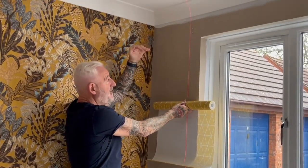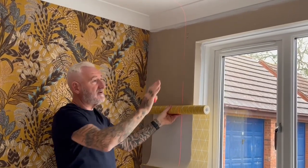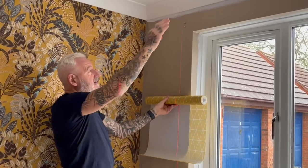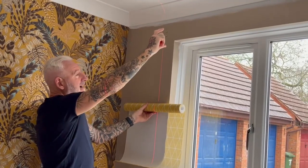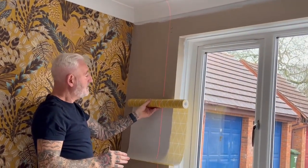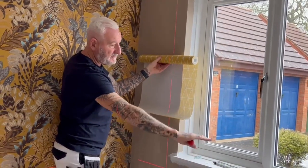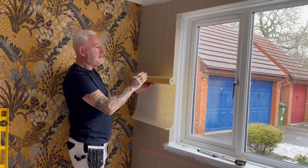Your ceiling line might not be straight — it might horizontally be moving up or down. You disregard that completely. Your paper must be straight all the time, so if a ceiling line runs out and a pattern becomes more obvious — you see more of a pattern or less of a pattern — there's nothing you can do. You have to hang your paper perfectly vertically so all your patterns are vertically level with reveals, horizontally level with window sills. That's what you need especially with a pattern like this. If it was slightly out, you'd notice it.